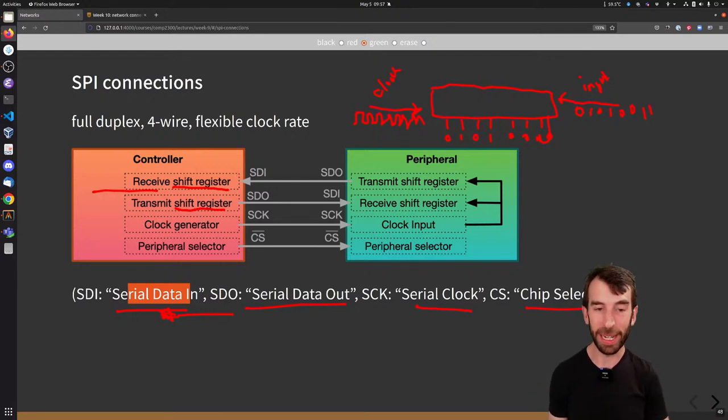And so that kind of hardware will be used to create a serial sending and receiving system that doesn't have to rely on a timer to get it to work, right? It can work just with this clockwork, non-software hardware thing. Shift registers, they're not imaginary, right? You can go to Jaycar and buy a shift register as a little chip. Looks like a little bug, right? And use it in a project, but they're also built into a CPU as a kind of built-in component.